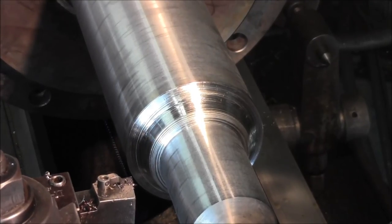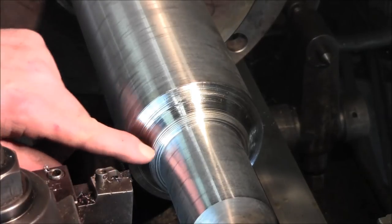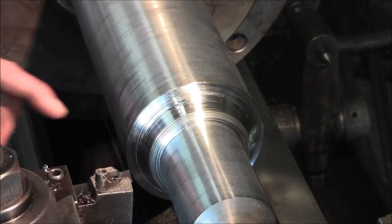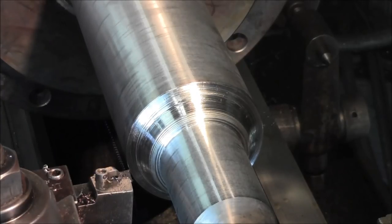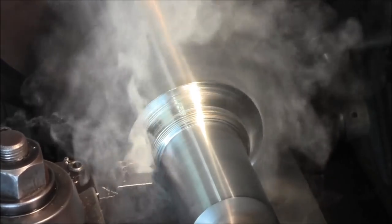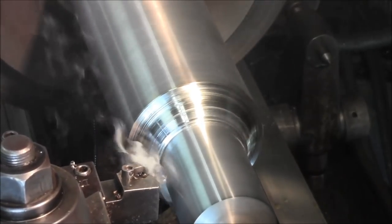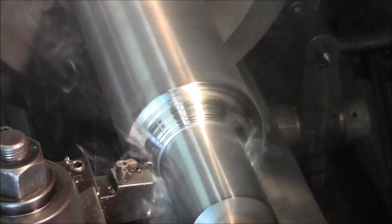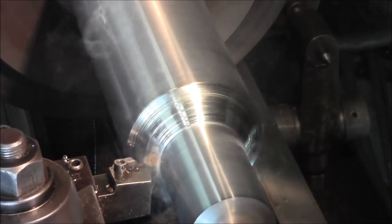I've turned my tool bit just a little bit — 90-degree approach to the part. We're just going to whittle a little bit of this away by hand; we are going to make up our pattern with a tracer attachment to do the finish, but I just want to show a bit more maneuvering by hand. It's almost like milling with a Bridgeport — you're controlling your X and Y with two handles. As you're bringing it forward, you're cranking out. You learn it, and you can look over the horizon of the part and see convex, concave. Sometimes you might feel more comfortable only going in one direction.